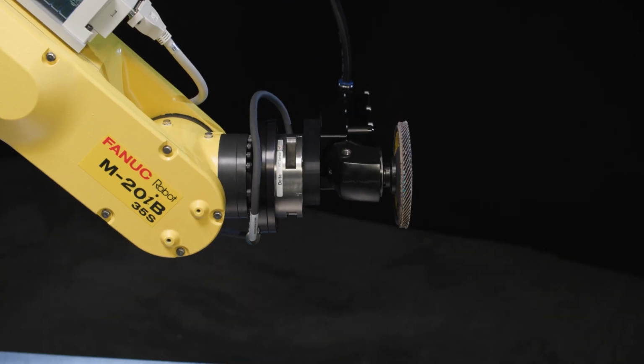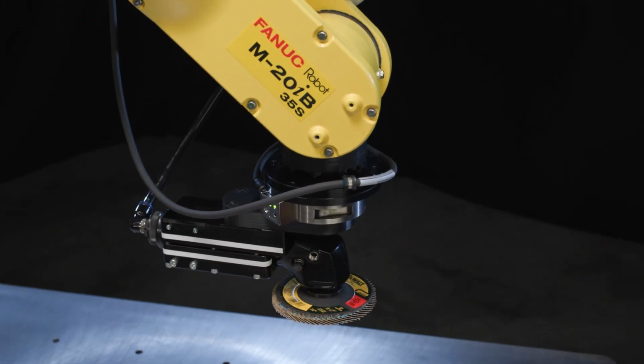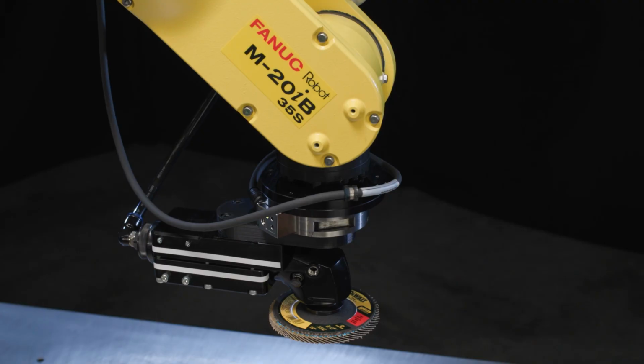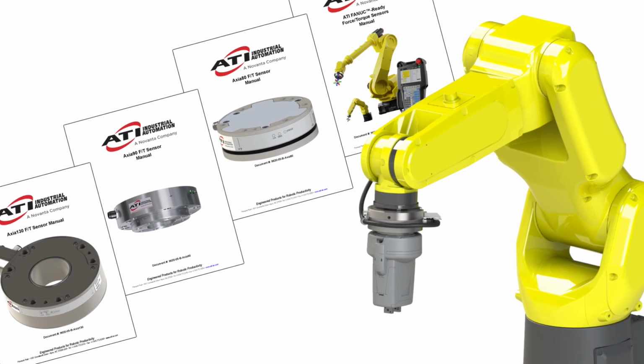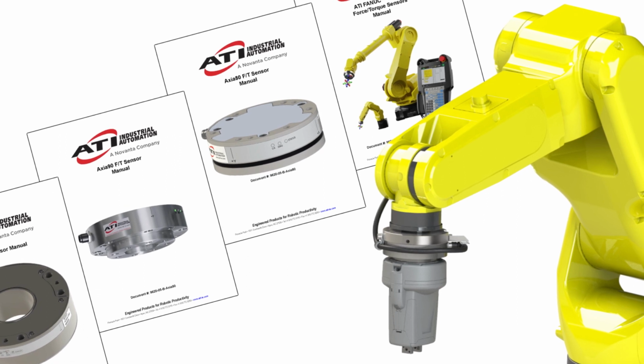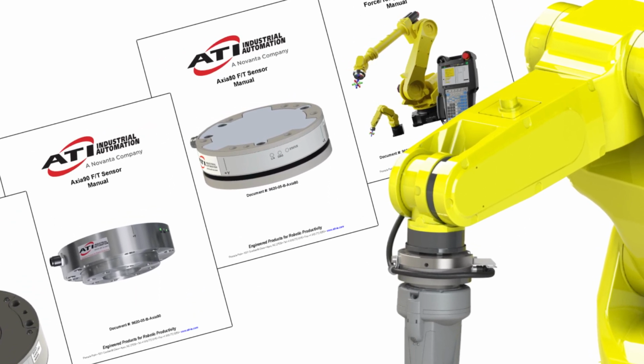Force torque sensors have load limits. If these loads are exceeded, even when the sensor is not powered on, the sensor can be damaged. Refer to the ATI documentation for your specific sensor model, and keep all applied loads within the calibrated range. Be particularly careful of moment or torque loads on small sensors.